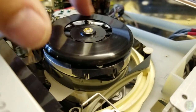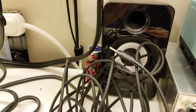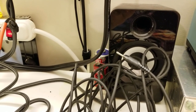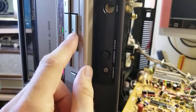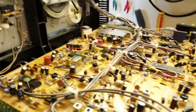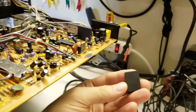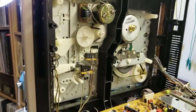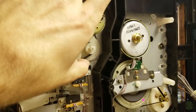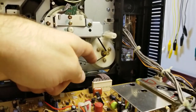I'm gonna take a look on the bottom side here. I opened this up so I could see what's going on on the underside - a couple screws and I had to remove this little rubber cover on the back for the PCM switch. Then this can just sort of work its way in and fold down, and I can see all the belts that need replacing. This belt isn't too great, that belt's not too great, and this belt for the capstan is just awful.